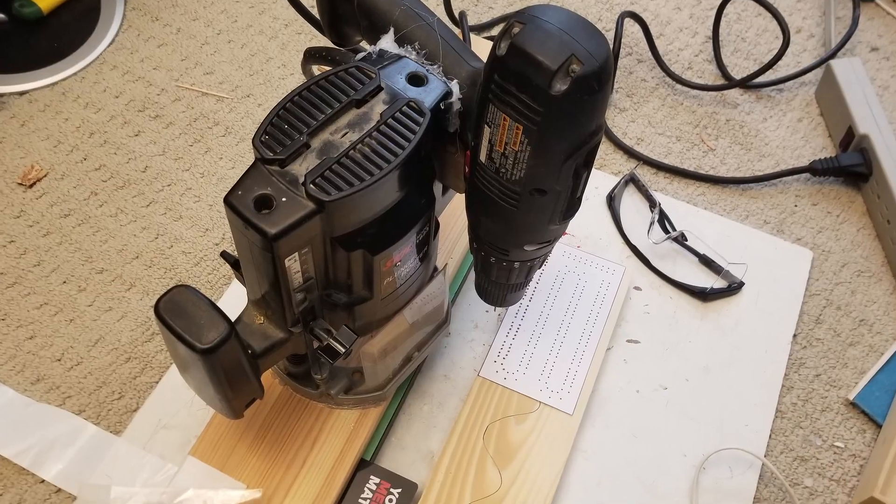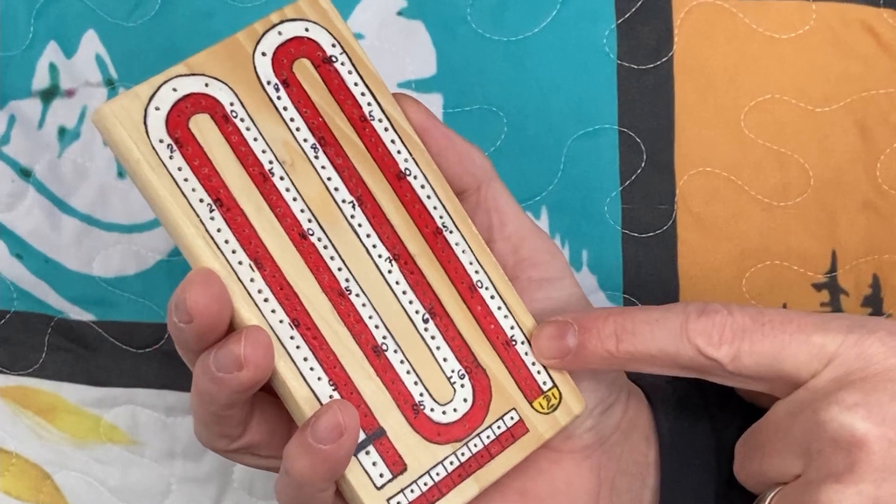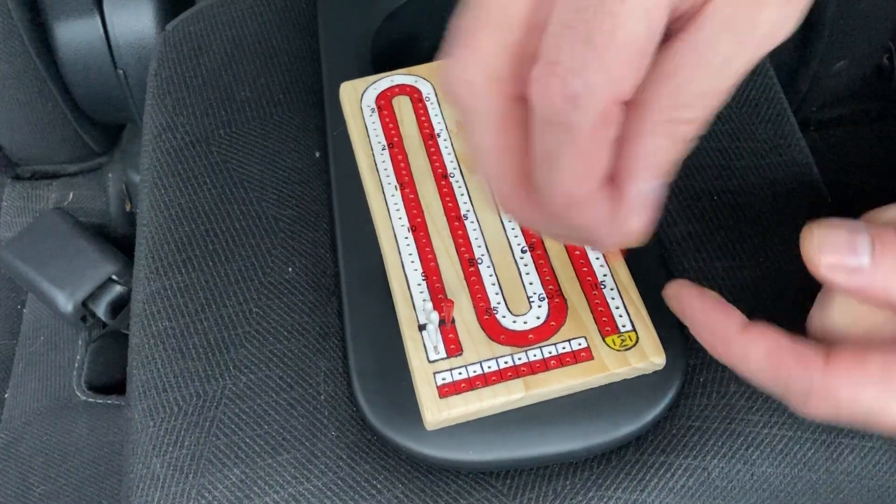I put the wood with the template down on a board, then set up my router and makeshift drill press above it. I even glued the router to a board so it was more stable. Then I just slid the future cribbage board up and down and drilled all the holes. I had the drill set up with a plug and power bar so I could turn it on and off, with a piece of wood holding the trigger so it was basically just an on/off switch. There was a little bit of wander in the drill bit — it bends a little as it goes. If I were to make this again I'd shorten how much of the bit was exposed to improve that. The holes aren't perfectly straight, but it gives a homemade charm, and they're close enough that you don't notice right away just looking at the board.